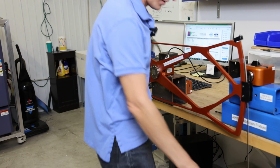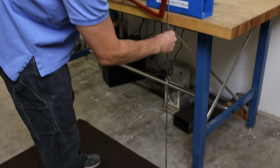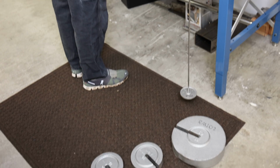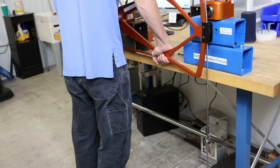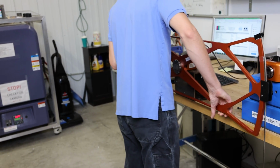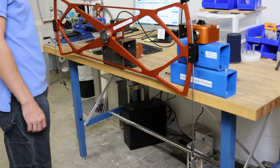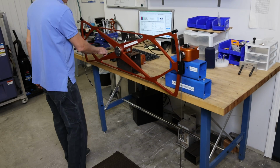So we have a balanced load, and we're going to put a small load on this side to get it exercised. The first step is to manually give it full scale. You can put weights on to do it correctly, but the quicker way is just to torque it to let it sit towards the side you're about to measure. So it's like putting roughly full scale on it to exercise the unit in the direction you're about to calibrate to. I'm going to tare